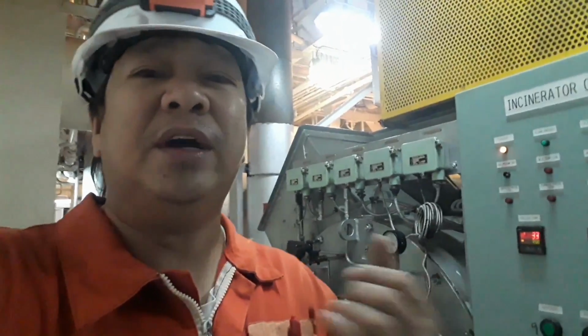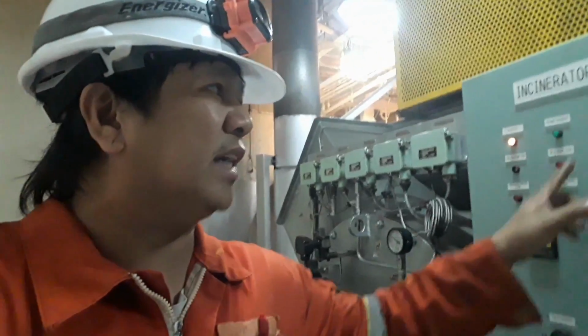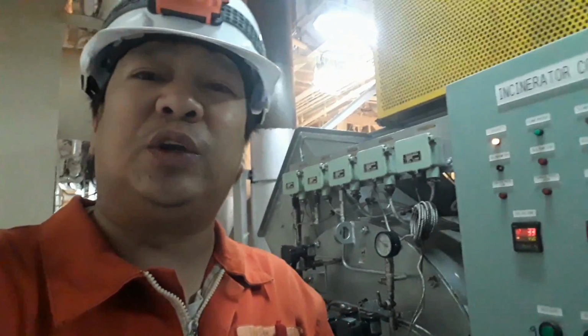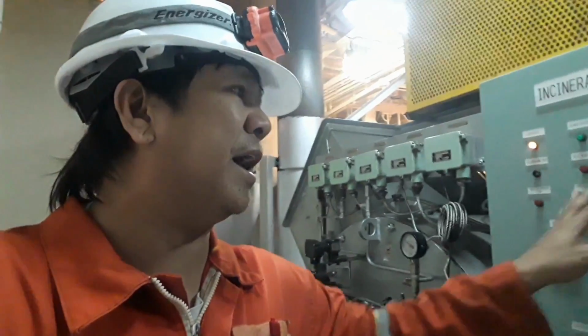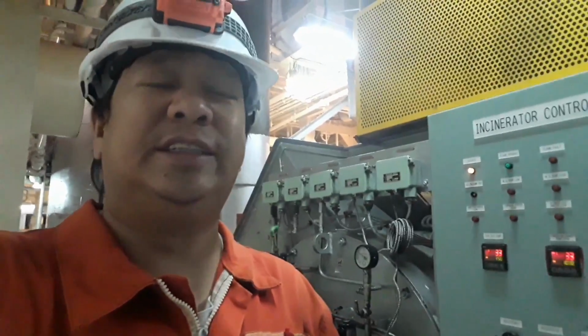I will show you how to set up your diesel and your supply air, and then one by one we will test the flame, temperature high, pressure low, pressure high, and atomizing air pressure. Everything I will explain later.